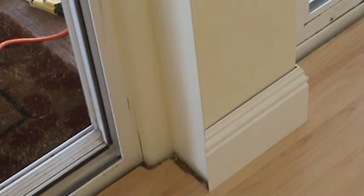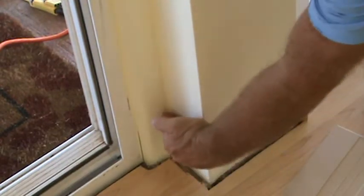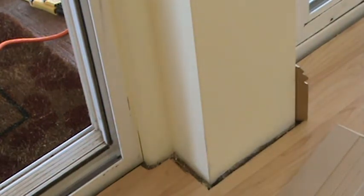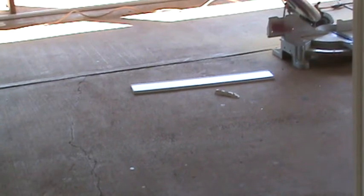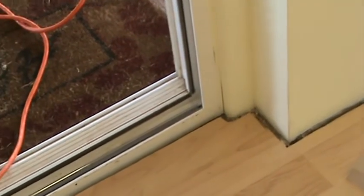You're going to cut this one the very same way as we did the other side — cut the inside corner first, line that up, make sure it fits. Pull this trim all the way, make sure it fits up in there, and score the other side. Flip it around, you're gonna cut it off just like I showed you. See that piece? That's all I got left, so I've got to work it out of there. That's why I want to do this long piece first.